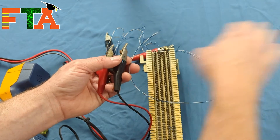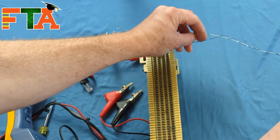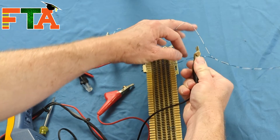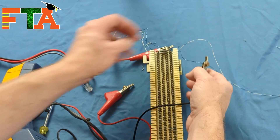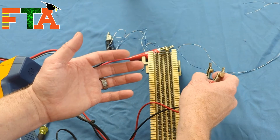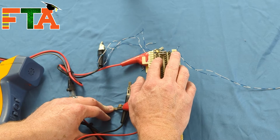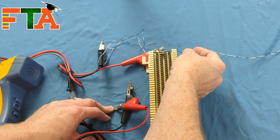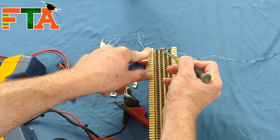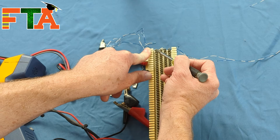Another way to test is with cable that goes to equipment — you don't want to cut it. The alligator clips allow you to split it in the middle and put on your alligator clips with the bed of nails; squeeze that down, keeping them separated so they don't kill your signal. Now the theoretical dial tone has made it all the way from the telco through the bridge clips to the other side. If you have several devices connecting to the same POTS line, you can have the telco punched in one row, and additional sets of internal wiring on successive rows — theoretically three different devices connected to the same telephone company source.